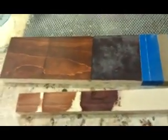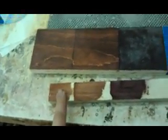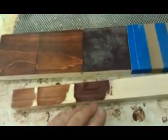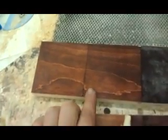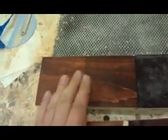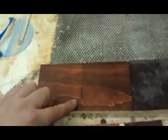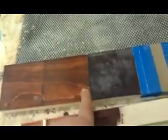So in doing that, as I opened up each can of stain after I shook it and then stirred it, I just wanted to verify that these are not too close to each other. What I did is I put a piece of blue painter's tape across here, stained this first section, wiped it, took my compressed air nozzle, blew on it for a couple minutes to make sure I flashed off all the solvents, removed the tape, and put the tape over on the other side, on the stain side, so another clean palette here, and so on and so forth.